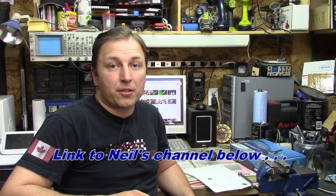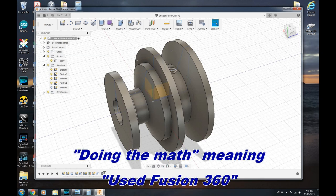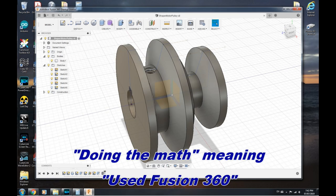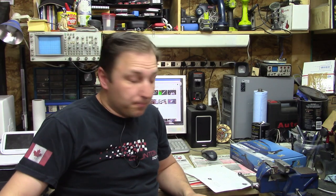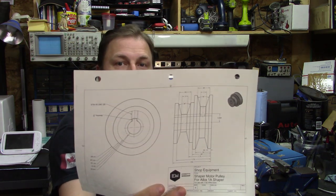The motor that came on this thing originally was 960 RPM at 50 hertz. The motor I have is 1725 RPM. Very thankfully, Neil from his channel Neil9 has a Shaper very similar to mine and did a bunch of work to rebuild and work on his — his motor's still original, which was really handy. He was kind enough to take some measurements and send them to me. I did the math, converting from metric to Imperial because that's what I have for tooling, then went to the CAD program and got a diagram for a pulley with all the measurements — being a smaller double B pulley shiv, with 34 degree included angle between the walls.